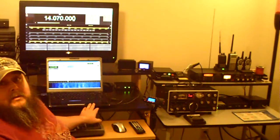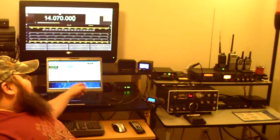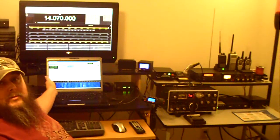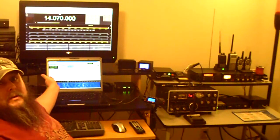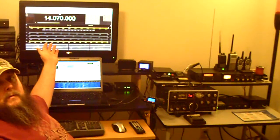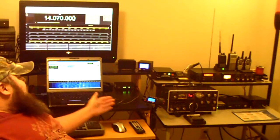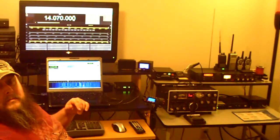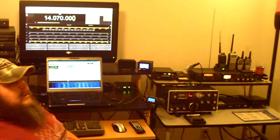Coming into the laptop on the desk, I've got the USB SignaLink hooked up and the CAT control cable for the FT-857D. On this laptop I've got dual monitor capability — I've got a monitor plug-in on the side of the laptop and it's plugged into my flat screen television, so I can run dual monitors. Right now I've got HRD on the big main screen, and I'm tuned to 20-meter PSK 14.070, which is where all the PSK31 activity is. I'm running DM780 for my digital modes.